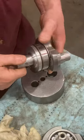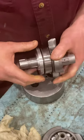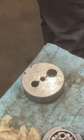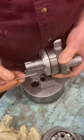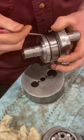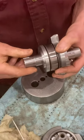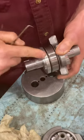When this is installed in the motorcycle, it's very important to use a very, very tiny amount of Loctite — I mean a tiny amount. The tip of this pick is about the size of the drop needed, placed on two sides, 180 degrees apart and 90 degrees from the engine parting line.